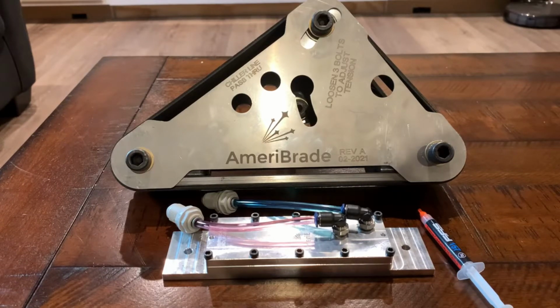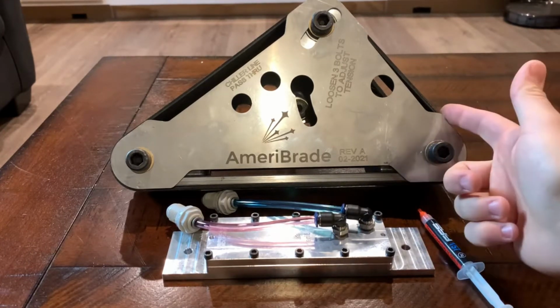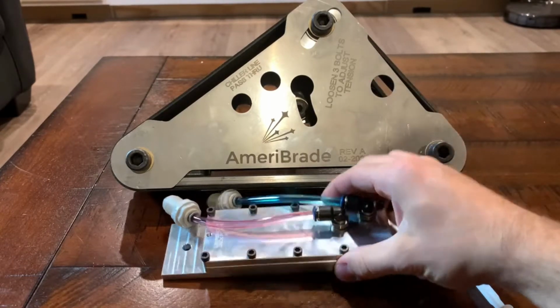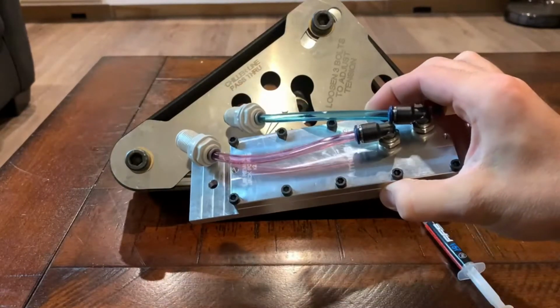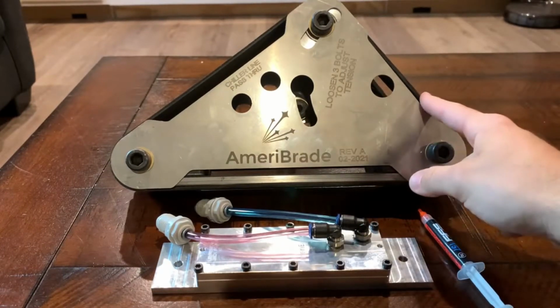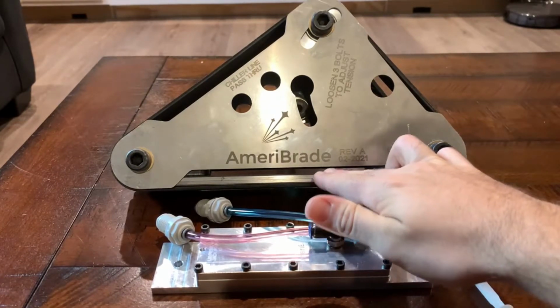So far I've used it a little bit. It's a pretty nice, well put together piece of equipment. I'm pretty impressed with it so far. The price point is pretty awesome. It does definitely benefit from a platen chiller though, to get the most out of it. The belt heats up pretty darn quick even when you're not actually grinding on the platen.